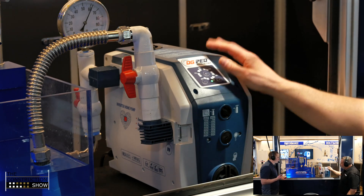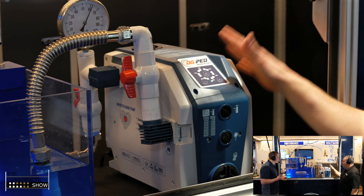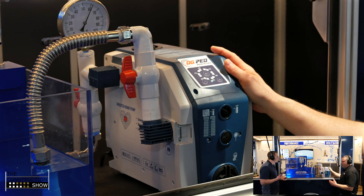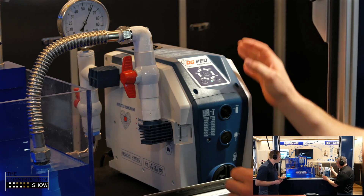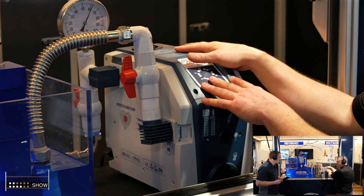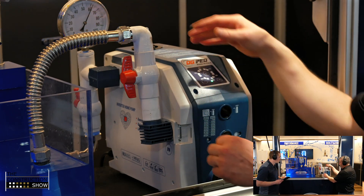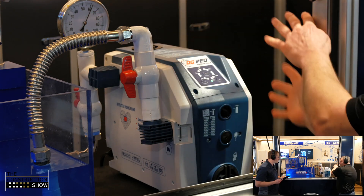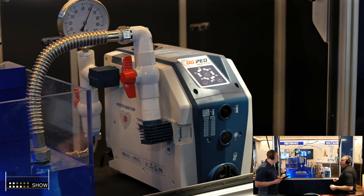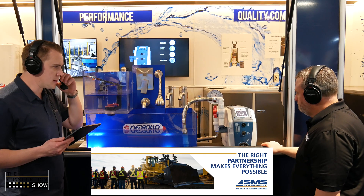It simply connects to the pump with a retaining fork — you just slide it in. What's nice about this feature is if you ever need to remove the DG-PED for maintenance or service, you don't have to cut the pipe. You simply turn off the power to the pump, drain the pressure, remove the forks, and the fittings come out so you can move the DG-PED out of the way.